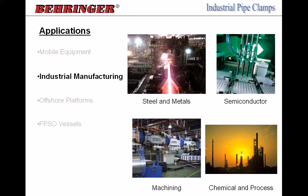Machining centers, you can look down at this picture and see there's piping and cables and conduit and tubing run everywhere. You've got machines all throughout a shop like this that have, a lot of times, a central coolant system, and you've got coolant running to each machine and back, and there's sumps, and they all run back to a central system. Any of these electrical cables and plumbing or anything like that in between all need to be supported.